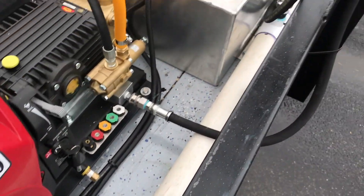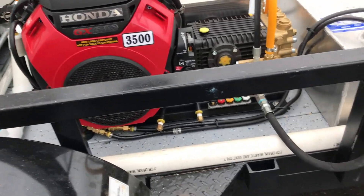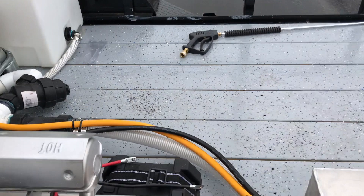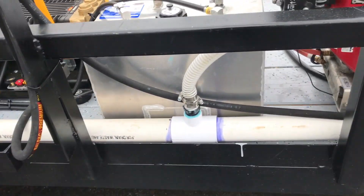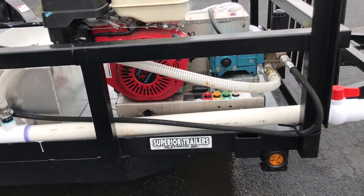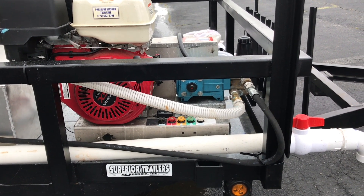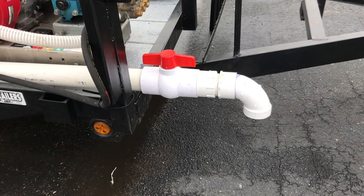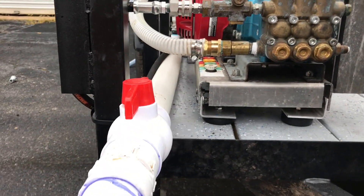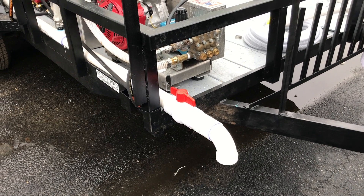This manifold runs along the whole length of the trailer out to the front. The eight-gallon-a-minute machine was tied in from the other side on the inch-and-a-half tubing, but as the two-inch manifold continues forward we tee into it with a one-inch crush-proof pipe that connects directly into our four-gallon-a-minute machine. Off the front we have what we call a dump valve — two inches — and you can open it to dump the water out of the tank at the end of the day or whenever you need.